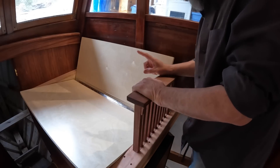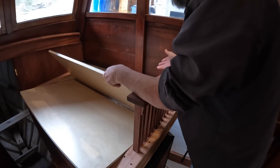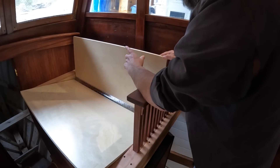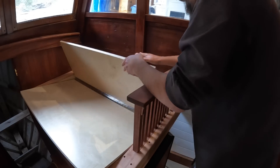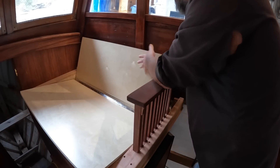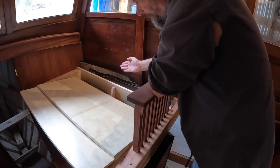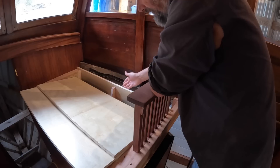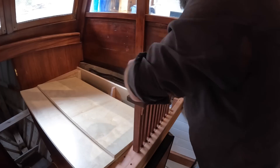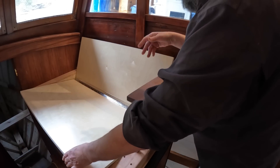I have some bungs to put in, but first I have to deal with the back support here. Please disregard this horrible pre-finished birch — it was a very bad idea and will be replaced with something much nicer. I need to build a shelf in here that's contoured to the side of the boat to support the back of the backrest when it's in the up position. It also has to create a stop at the end — this is exactly 75 inches, which is the length of the bed — so when the panels are sitting here in bed mode it's all held in snugly.